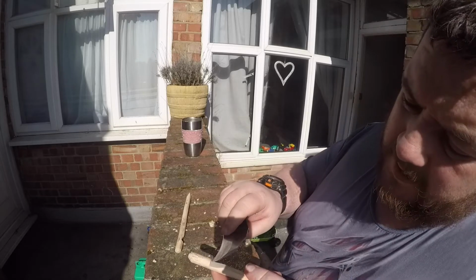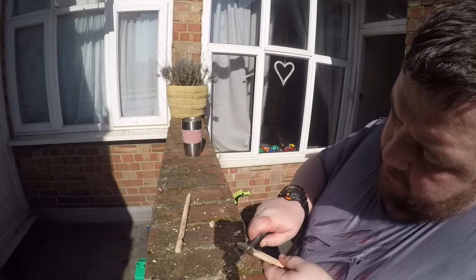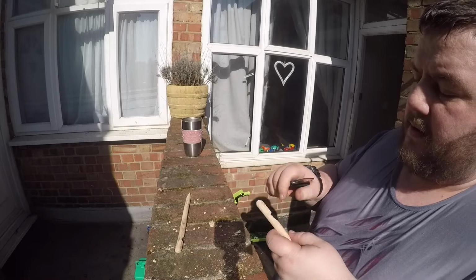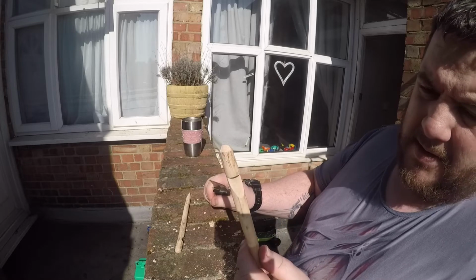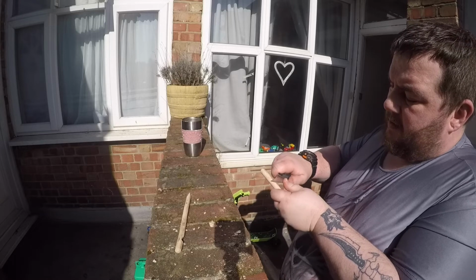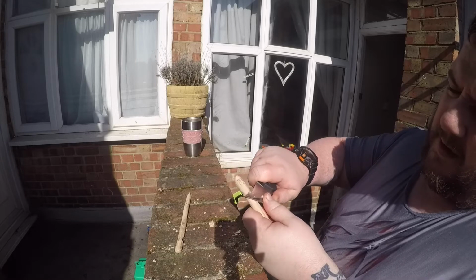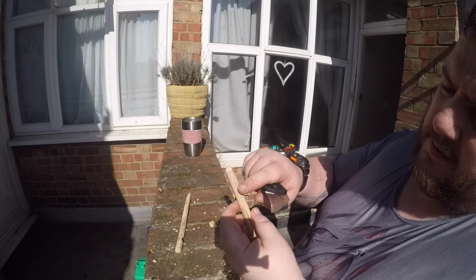Sometimes you'll get these fluffy bits in here. So what you do is just go back down and press nice and hard, like you did with the original when you did your stop cut, and then just turn your blade away from it. And then bring that one back to it gently. It'll give you a nice clean cut. And then just gently take off the side there and round it in to your flat section. Yeah, so this one's sharp, this one's nice and rounded.